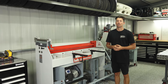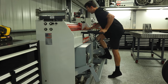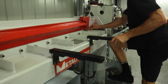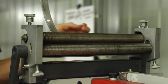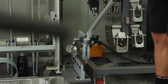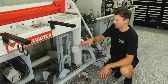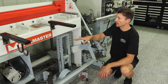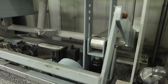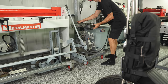This is a manual guillotine and it's used for cutting sheet metal. It has a capacity of 1300 millimeters by 1.6 millimeters thick, but I can push it to three millimeters thick, especially with aluminum. It's a manually operated machine requiring stomping down on the pedal to cut the material. I've made the most of the floor space here by adding a roller onto the side and a thicker guillotine as well. Just like the manual pan brake, the guillotine is also on a roller base with caster wheels. I've made use of the floor space underneath by adding storage that holds my upright tube bender, a bar bender, and all of the dies — always trying to maximize space while keeping everything portable.